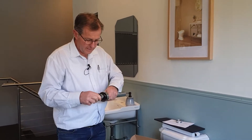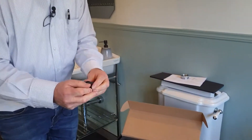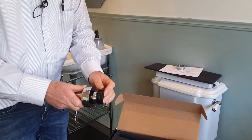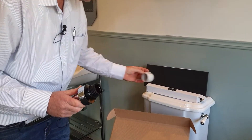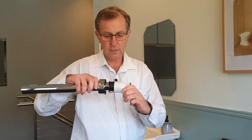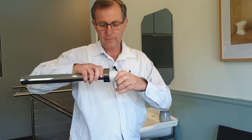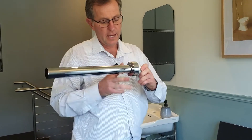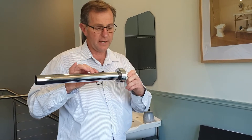As well as the black key seal, it connects directly into a 40mm PVC socket, so it pushes in there nice and tight up against the wall. The plumber then pushes the cover dome over — and as you can see there, that's fully sealed, ready to go, and fully approved to Australian standards.